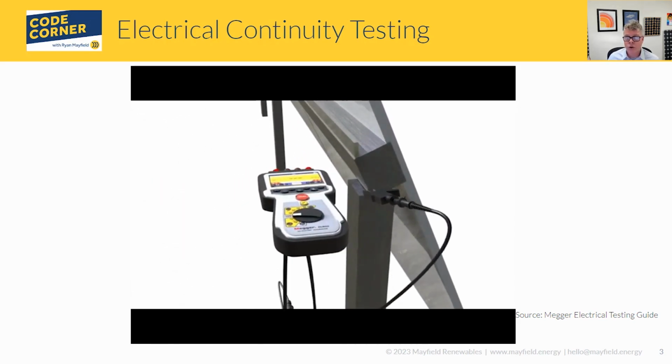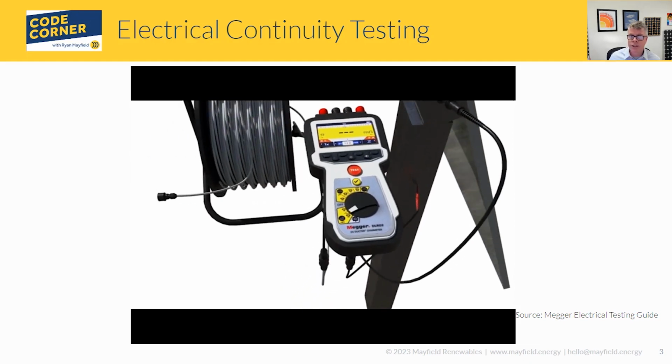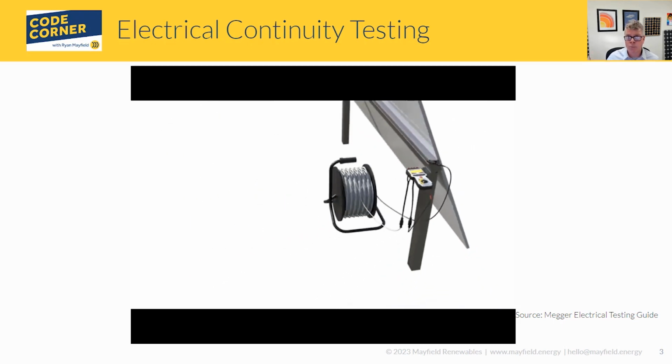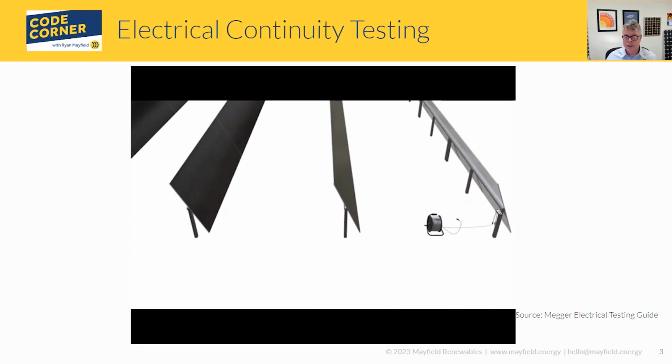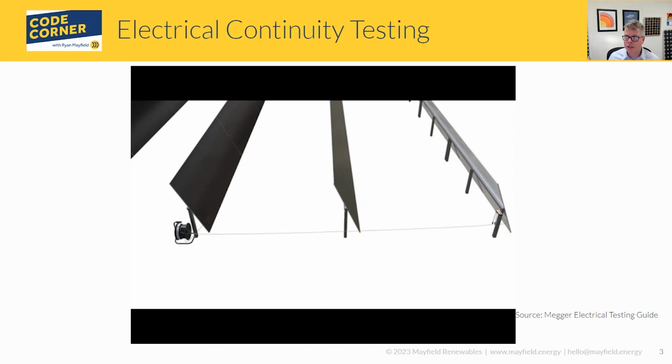What we're looking at here on the screen is using a digital low resistance ohm meter. A digital low resistance ohm meter, or a DLRO, is going to give you much more accurate measurements of the actual resistance between the two points, because it's creating a small voltage and a small current in order to calculate what that resistance is. So it's actually injecting a very, very small current, and so it's able to measure that resistance, as opposed to a digital multimeter just using point-to-point contacts and not being nearly as accurate.